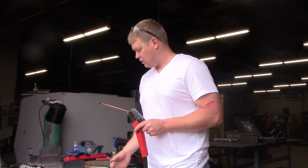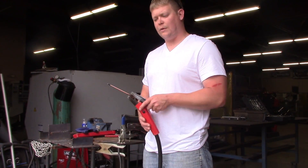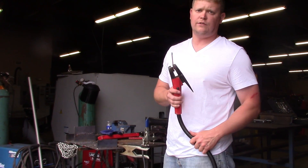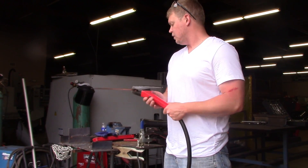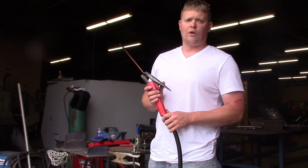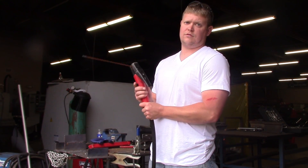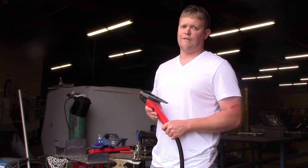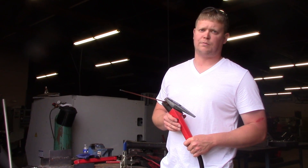So what we've got here now is we're grounded just like a regular welder. We've got a fillet weld here that we're going to blow out — I'm going to come over here and push this right through that fillet weld. You always want to push; if you drag it, you'll leave traces of carbon that have to be removed before you can weld on it again. A couple of safety things: you want to make sure you have earplugs because this thing is loud — mix that with a generator welder, a lot of amperage, stuff shooting everywhere. You're going to want earplugs and welding gear.